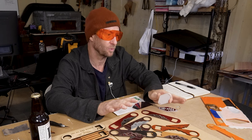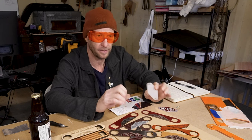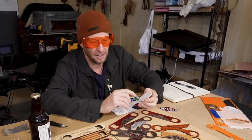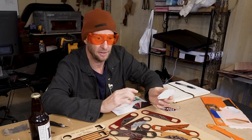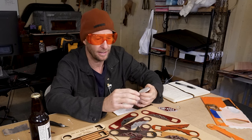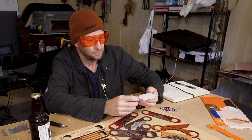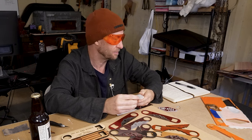Water isn't always going to help you when you're dealing with plastic. I have a fire blanket — I think that's the best solution. You just smother the thing. It's better than squirting something — you want a fire extinguisher around in a big emergency. But if you've just got a little fire you can put out, a fire blanket, turn off the air, make sure there's no air — keep oxygen away. That dealt with it no problem, and it's much better for not destroying your laser.